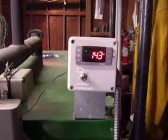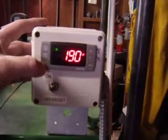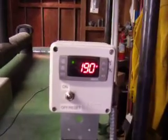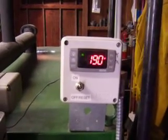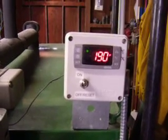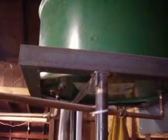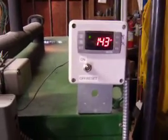The other thing the digital controller will do is let me set a maximum high. I have it set at 190 — if I over-temp at 190 it will also close the damper. So this acts as an additional boil-over protection. I have the expansion tank if it does boil over, and I have the digital controller as another backup.